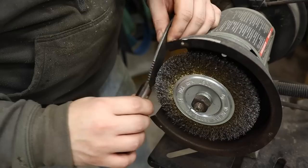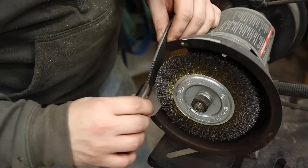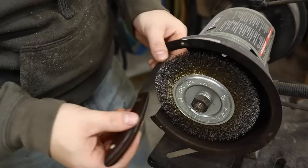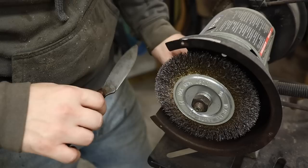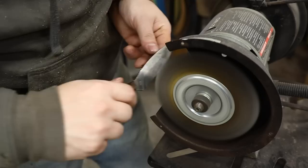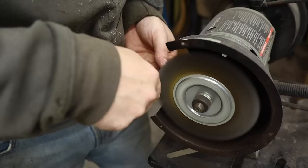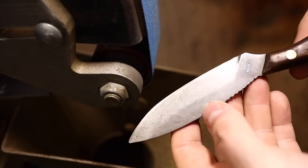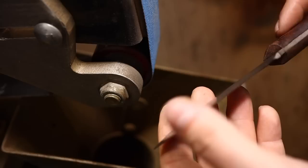Step one: a fine, soft wire wheel on a belt grinder. I'll get right in here next to the handle and rough over the blade to strip off some of the surface rust. We'll also get in there and clean out that jimping so it's clean, and clean up the rest of the tang. I won't bring the wire wheel back to the handle though — I don't want it to touch the wood because it will put claw marks in the wood. We'll take care of that in a different way. Look how we've just scraped off some of that surface gunk and rust — everything is nice and clean.